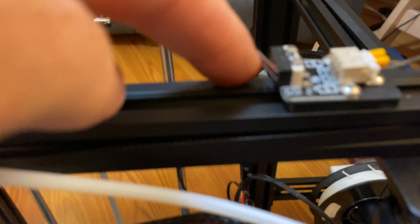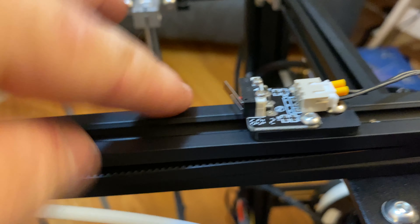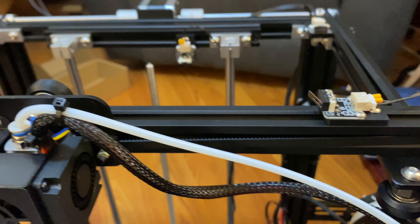Be very very careful when assembling this. Here's a really good example of two micro switches — you see this particular screw right here I had to put in by hand, and while I was wrenching it, if I had slipped I would have hit this micro switch. You can hear it click. That little switch is all plastic with a small circuit board, and that board is flexible but it will break if you hit it too hard.